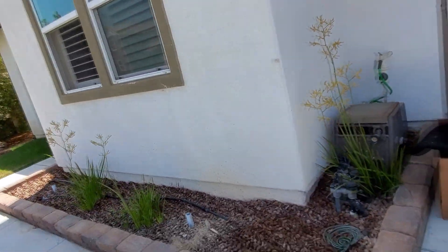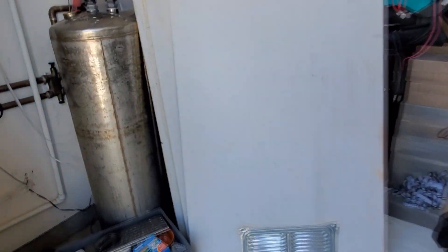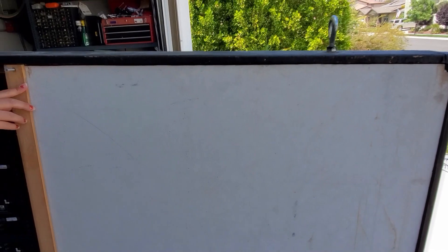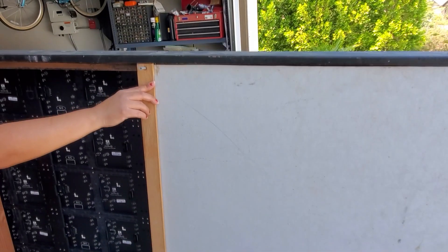One last thing I'll show you is the backer board. This is GoBoard — picked up at Home Depot or Lowe's, half-inch thick. If it gets on your skin it can get a little itchy. It just inlays and sits in here like that. Then these cheap half-inch thin studs hold the back on. You can pour water down it and it'll never get inside. It's very light, which keeps the cabinet weight down, and three screws out and I'm in the back of this thing.